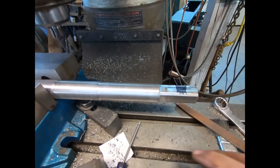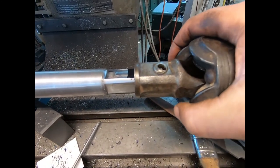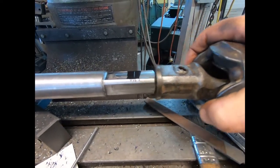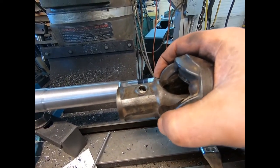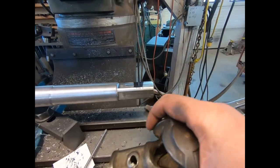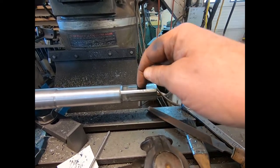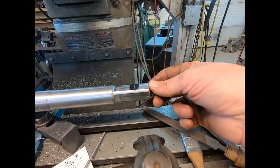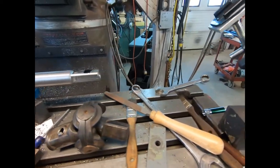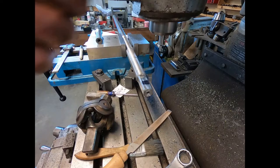I got it done. This is a little gritty fitting — there is a little bit of slop, as you can see, but it's kind of gritty and there's crap on the inside. According to the other shaft over there, I've got to have that hole drilled right there. So I'm going to take the edge finder, find the center, and eyeball it from the end, because I never really did get a measurement. I'll be back in a minute when I get set up.